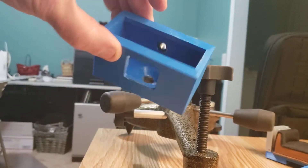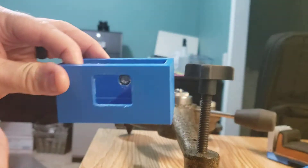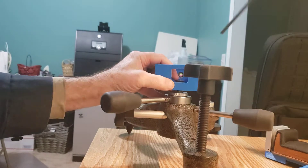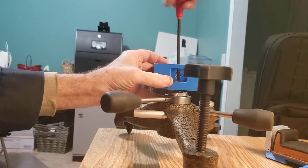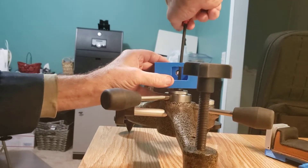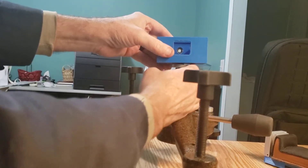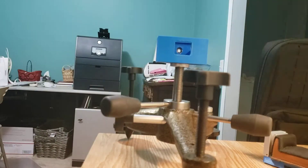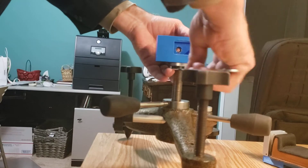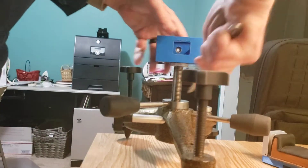This is the body. MrBCRC had it made in two pieces with a front piece that came off, but I modified it so I don't need to do that. It goes on with a single screw into the post, which secures the body. If we raise this up, there's a lock ring underneath that gets screwed up tight to the body. The Bald Eagle includes a wrench for tightening that, and now we've got it nice and tight.